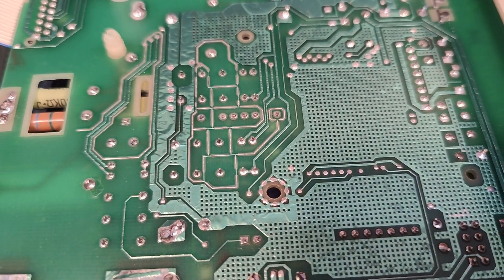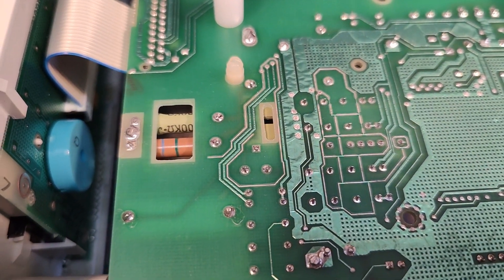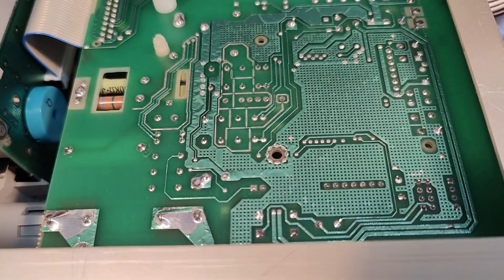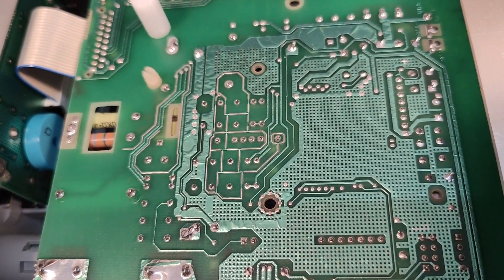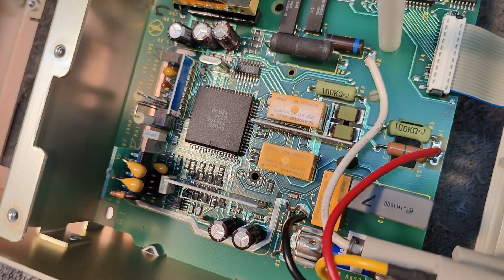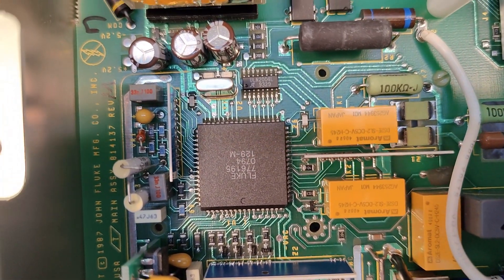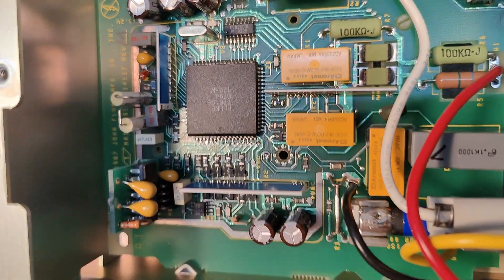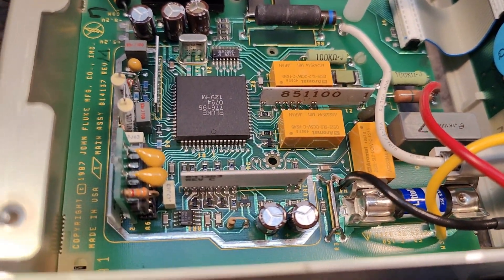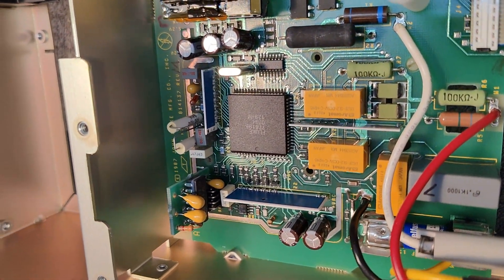All the leakage, creepage, shielding, guard rings, all that stuff — because it's, of course, high impedance. At that high impedance you don't want anything affecting your readout, because this is five and a half digits. That's a little custom chip by Fluke doing all the real smart things. We've got three of those Caddock resistors — or maybe they're from another brand, but they look like Caddock to me. Those are reference voltage dividers.